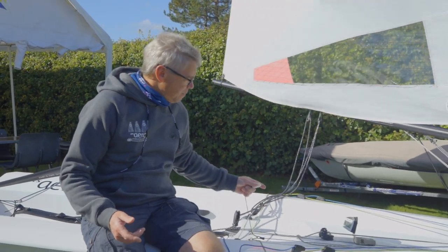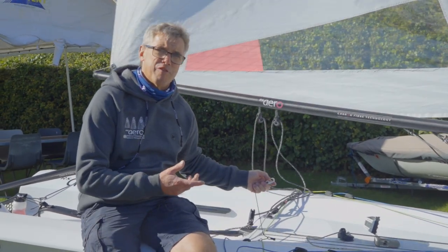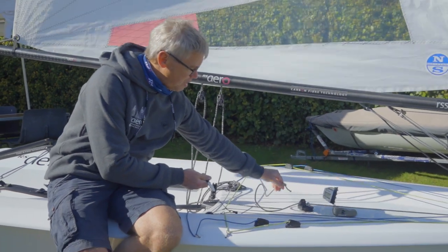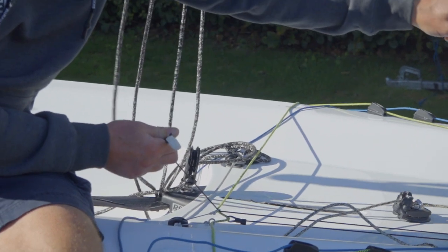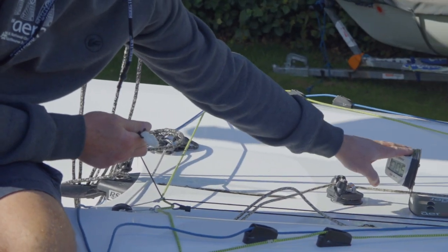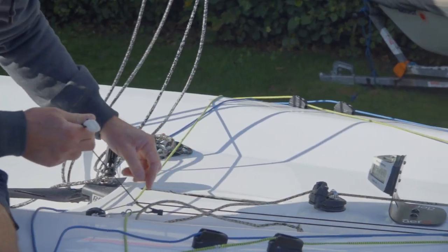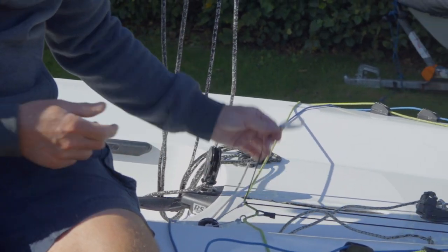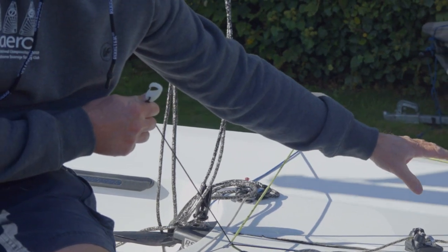It's a class rule that the daggerboard must be attached to the boat because we don't want to be losing daggerboards. There's enough friction in it that it won't fall out when you capsize, but just to be safe it must be attached. Bungee is good. Some people use the tail of the kicker so they know the kicker's always in the middle of the boat and they can grab it easily. I like to use bungee, but the standard way of routing bungee straight down the middle of the boat can get in the way of a compass and a kicker strap cleat, so it's good to lead it out to the side. I just use my downhaul takeaways to lead my fin bungee through there, and it comes up and pulls it off the centre line away from the compass and away from the kicker cleat.